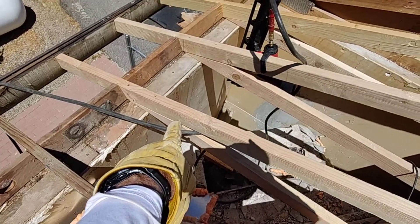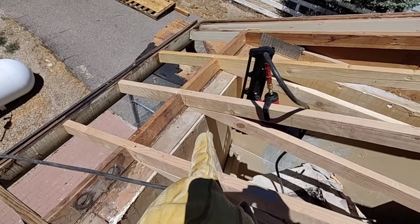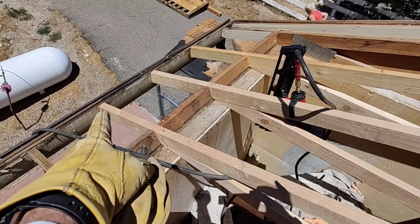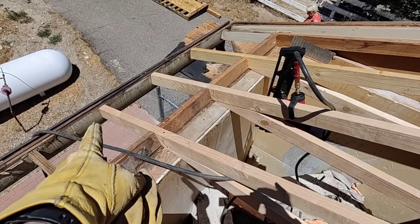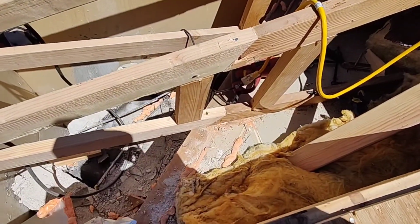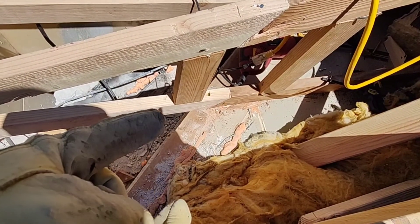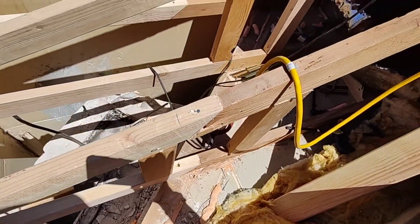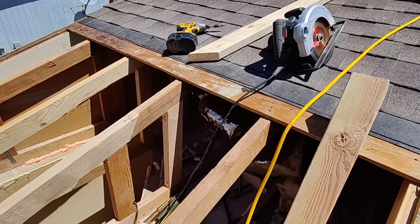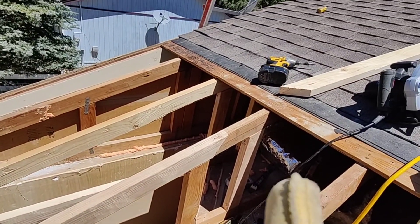I couldn't hold myself back from using some really long construction screws — these GRK Torx-drive really long ones go into the top plate, and then I put a second one that connects the top to the bottom cord, so they are at least tied together somewhat. I got all three now replaced, with the blocking back in there, toenailed in. I still need to attach the board out there which probably needs to be replaced sooner or later. At the bottom cord I put a long screw in from one into the other on all three, and at the top I nailed it — over there under the decking I did it with a screw.